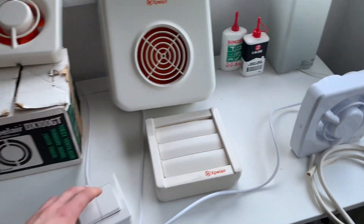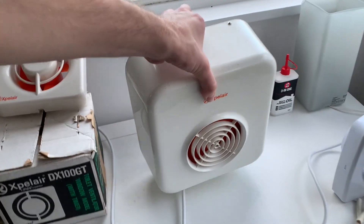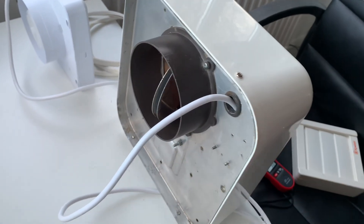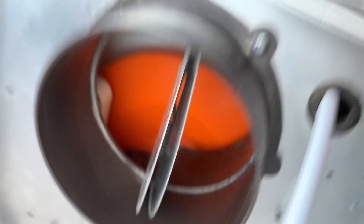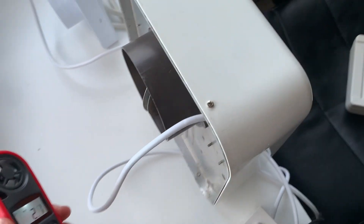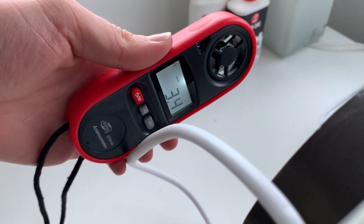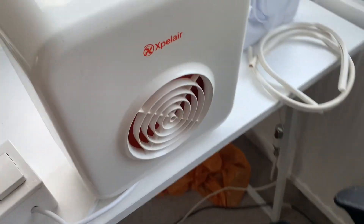Now I'm just going to turn that one off and turn this one on. Just hear the centrifugal force roaring into play here — this really is a properly heavy-duty fan. You've got full metal coverage at the back here, so it's got a pretty good weight to it. And it's even got these metal butterfly shutters, which are quite nice. Let's stick the anemometer on. Oh, blimey — already we've got 3.5. Yeah, looks about 3.5 to me — that is quite a significant difference.